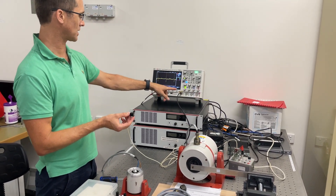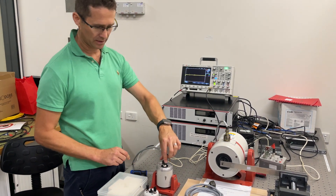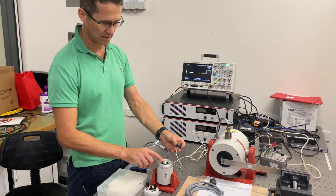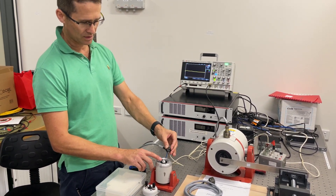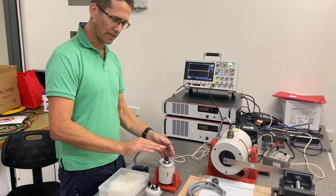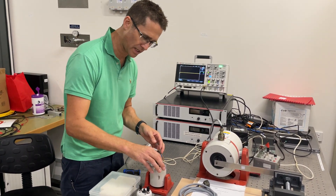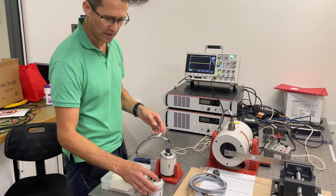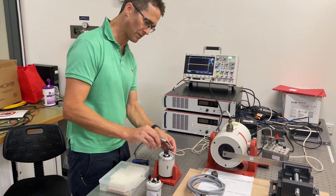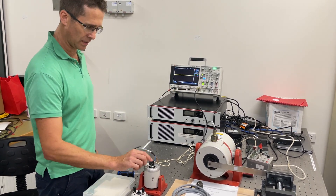On the oscilloscope here, I'm visualizing the output from this transducer so that we can confirm the shaker performs as expected. I'm using a little bit of synthetic beeswax to mount the accelerometer onto the armature of the shaker. We do have to press it quite firmly, which will deflect the spring on the suspension system. There is a dust shield around here to stop things falling inside the shaker, though it does eventually start to deteriorate a little bit. You do have to push it firmly down to get a good connection, and then we're measuring any vibration imparted on the shaker.